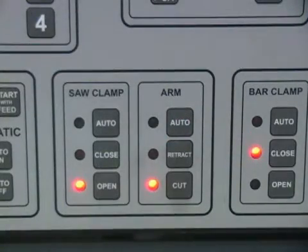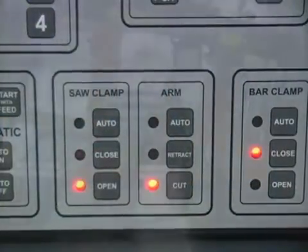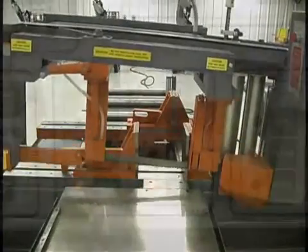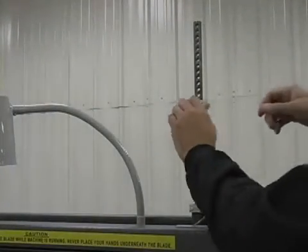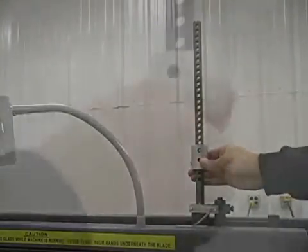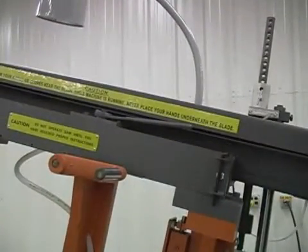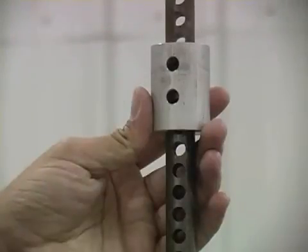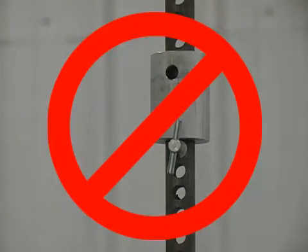The arm button panel has three buttons. The retract button raises the arm. The cut button allows the arm to fall. The auto button sets the arm to operate automatically during an automatic cutting sequence or job. The saw's arm height can be adjusted to different heights by moving the height stop up or down. Do not inadvertently place the upper stop collar pin below the collar rather than through one of the holes drilled through the collar, as the upper limit switch may be activated prematurely before the blade has cleared the material.